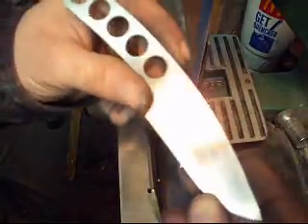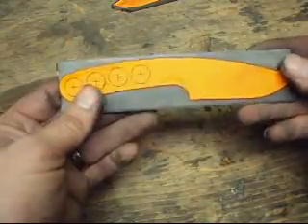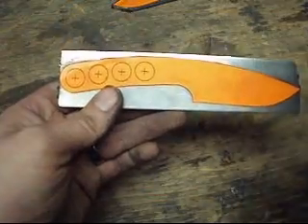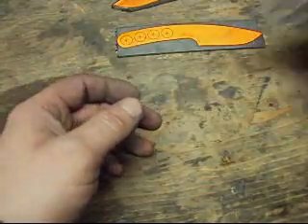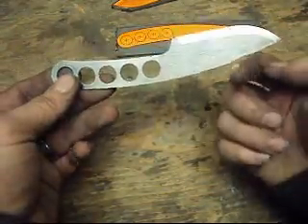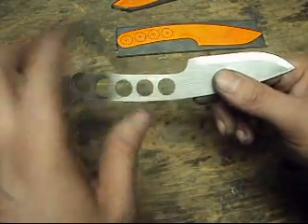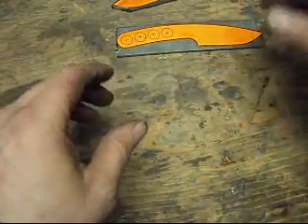I hope you've enjoyed the tutorial and the explanation of the ironclad. I want to add a little more explanation: I have a degree in computer-aided drafting and design, which is why I do all my designs on CAD on the computer first and get that all figured out before it comes onto metal. Same thing with the grinding jig — it was all done on CAD based on the design of the finished knife. The curvature here determined where the pins were located, the locating of the bolt-in hole, and keeping the top of the blade flat with the top of the grinding jig. All of that was engineered and designed on CAD before it became a working part.